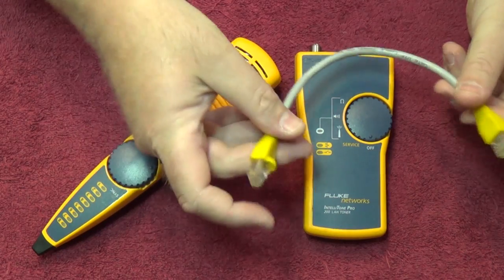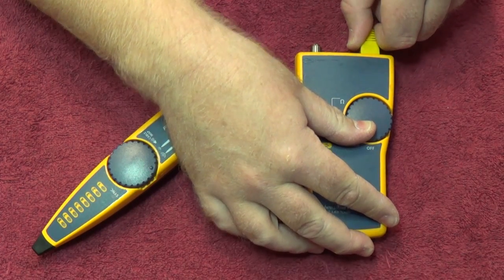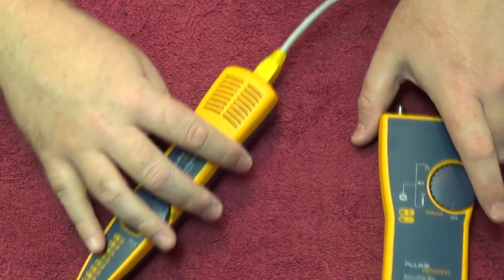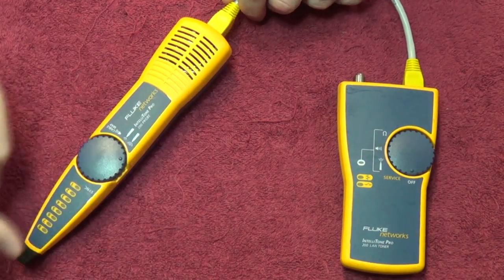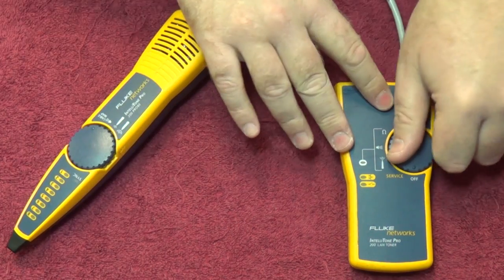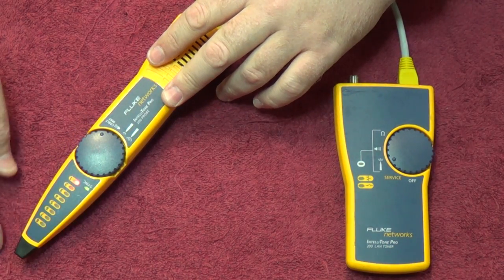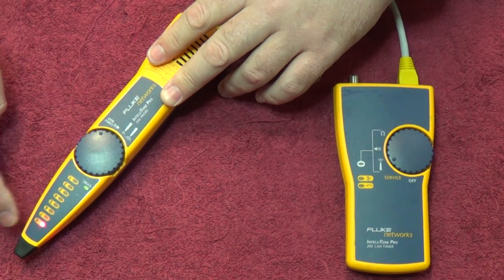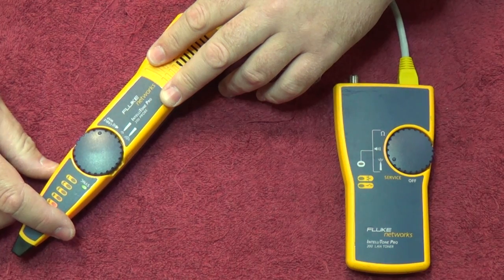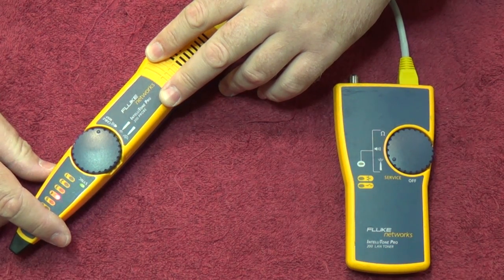The simple way of doing a test: we've got a little piece of CAT6 UTP patch cable we want to test. You basically slot it into the toner. Bearing in mind we're doing a cable test to see if the cable is working properly. You run it down to cable map, rotate it to on, and then you can watch pins 5, 6, 7, 8 cycle through. You can see it is working well. It's telling me sync and connections — this cable is good.